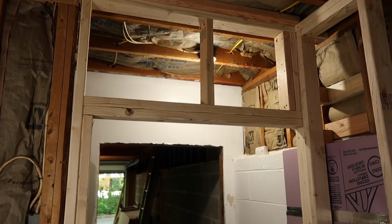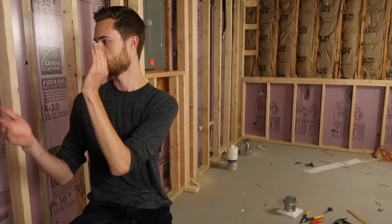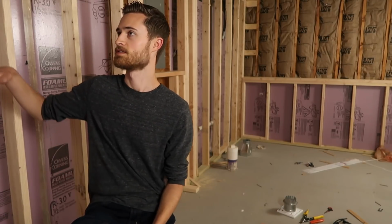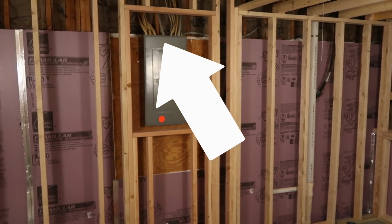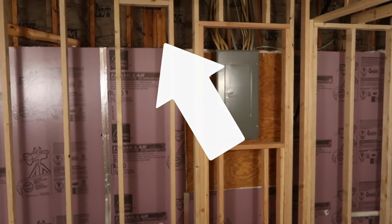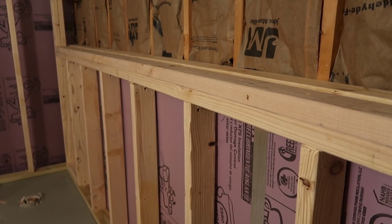I also had to build some doorways, but it's easier to attach drywall to wood. That's what you're supposed to do rather than attaching it to concrete or a cinder block wall. Now, yeah, you can take 2x4s and attach them directly onto the concrete wall and then just slap the drywall onto there. I could have done that and it might have saved some trouble. But because the cinder block wall only goes about 7 feet up, there would then be a ledge, because there's normal stud wall above that on the exterior of the house. Really, I wanted it to just be a continuous straight wall the whole way up, with the exception of that wall where the ledge is lower, and so it's actually useful.